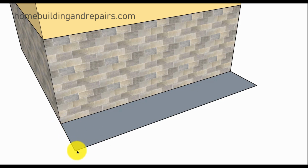And we're going to start with a rectangle. This is going to be the width of the stairway and the length of the stairway. And all we need to do is divide the length of the stairway up into equal measurements if we want to have equal steps. And if you notice the line here, this is the line that was even with the top of the slope. And then all we need to do is measure down the distance here.